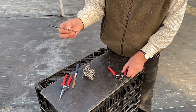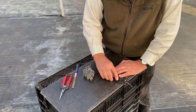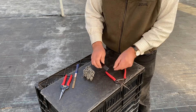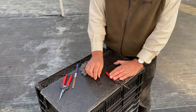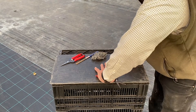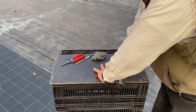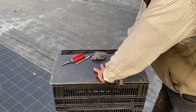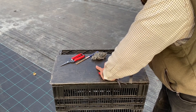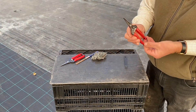Then we have a diamond sharpener. What I tend to do is just run it over on the flat edge first to make sure there's no burrs on the inside, then flip it over and do the same on the other side. For sharpening the angle, I just hold it firmly and press down on the angle with the diamond sharpener three or four times, starting from the inside to the out — the same again on the other side, inside to out — and that's ready to go.